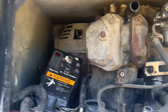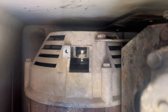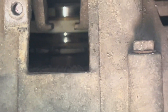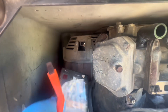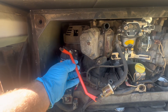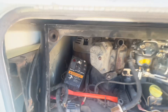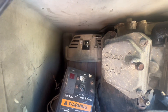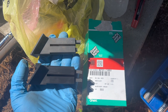I've removed the air box and taken the control board out, which allowed me access to where the brush block was. The slip rings are back there — the bottom one has some pitting on it, hard to see in the video. The Cummins service manager recommended this cleaning tool from Grainger — about $50 with delivery — part number 426P77. That's to clean the slip ring before installing the new brush block.